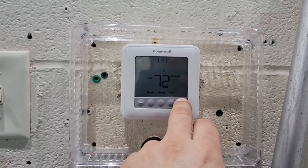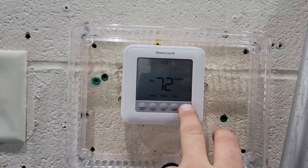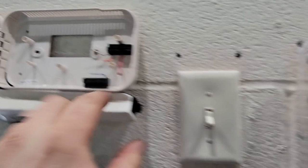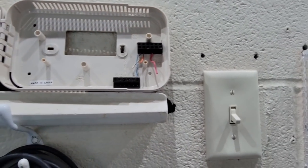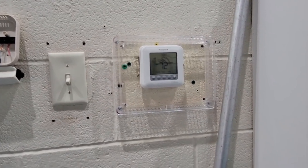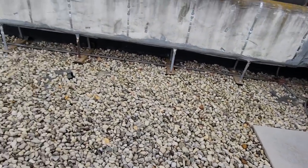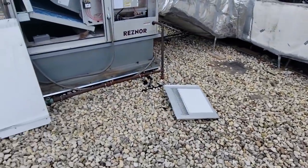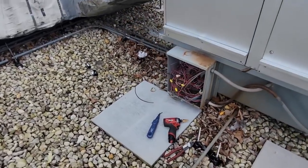Their water temperature they're trying to hold at 84, so we'll run about 86. The fans weren't even hooked up on this other one, so they're doing that off Y1 and Y2 — that should get us started. I got the wire run along with that one there, wire-tied. It's not the way it should be done but they can fix it when they come back to do all the other stuff — it'll be good enough to get the heat on and get things going.